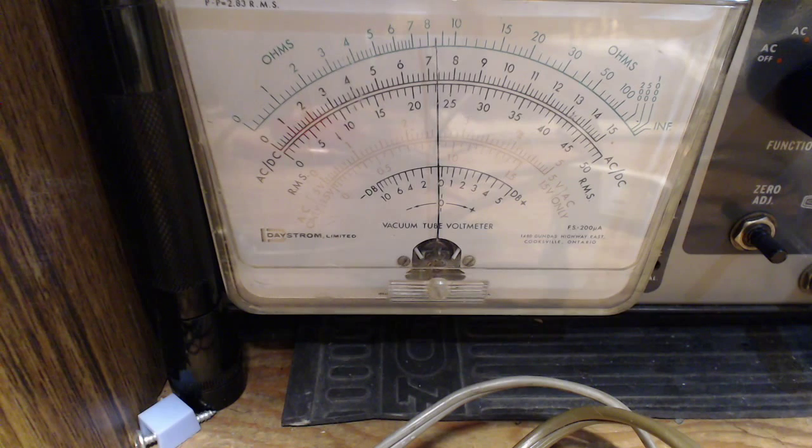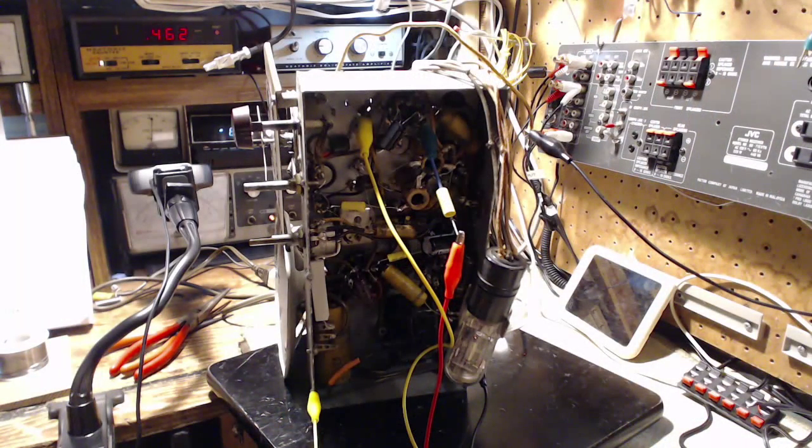Okay, usually the variation in line voltage from, say, 90, 95 volts to 115 doesn't do much to a radio, except make it a little louder normally, but certainly during an alignment we should have full power on it, just to be sure. Okay, now the next thing is